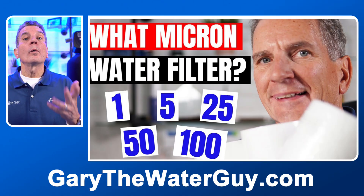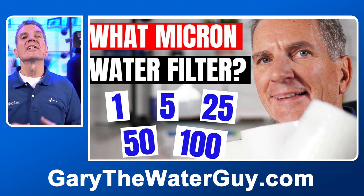If you're not sure about what micron sediment filter you need, check out my video — I've got a link in the description below. Now whether you're on well water or a municipal water source, you may very well need a water softener. If you've got a tank like this one in your basement with a reservoir beside it that holds salt, it may very well be a water softener. If you're on a lake water source, it may look like a water softener but it's probably a tannin filter, which uses salt like a water softener but uses a whole lot more salt.